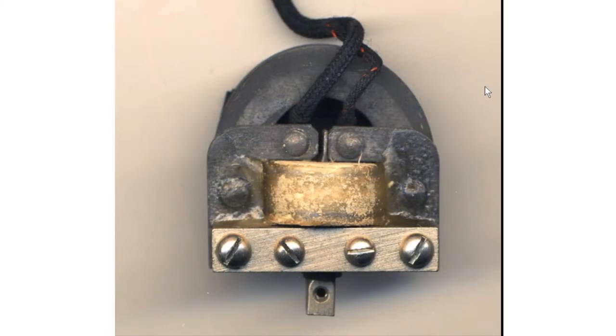Okay, we've taken the works out of its Bakelite casing. It's a very well made thing, and here at the bottom, where the needle screw goes, we've got the bottom of the armature, which passes up through here where there's some suspension, through the big coil, and it emerges at the top where it's flattened, and this is usually called the fishtail. And this is in between these two pole pieces of the horseshoe magnet here.